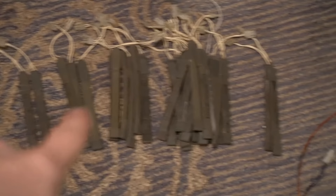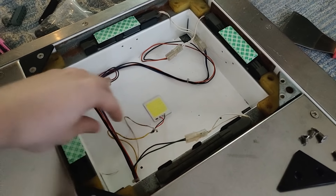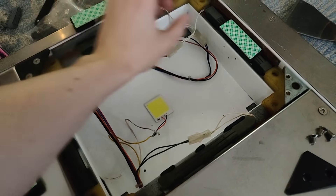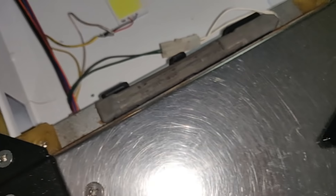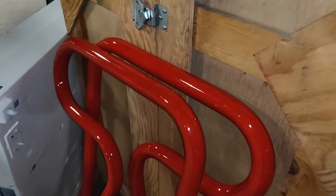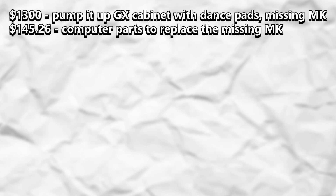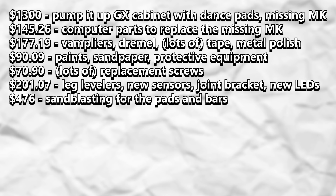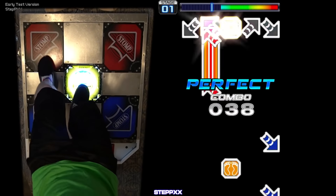I brought up sensor channels just a second ago, but I haven't actually explained what sensors are. Sensors are the thing that detects whenever you're actually stepping on a panel. There are four of them in each panel frame. A lot of sensors in these pads were either missing or broken — I'm pretty sure I have 30 working sensors, five are dead, and five are missing. So I went ahead and ordered five brand new sensors. They're beautiful, all wrapped in plastic. The general strategy I've picked up on is that people will take all the sensors out, test them one by one, and then order them by sensitivity — least sensitive to most sensitive — and use that information to determine where each sensor goes in the pad. The middle range sensitivity will go in the center panel and the inner corners of each corner panel. Lower sensitivity ones go on the outside since you're less likely to interact with them there. And usually people exclude overly sensitive sensors because nobody wants their panels triggering too early or getting false presses.